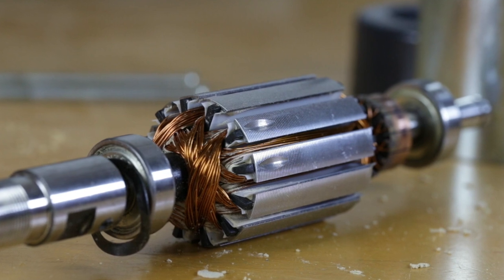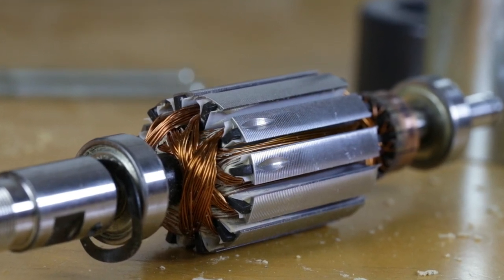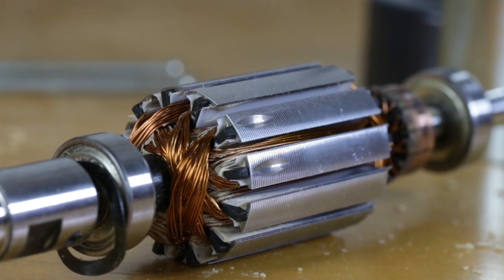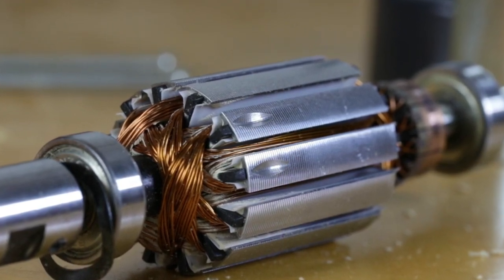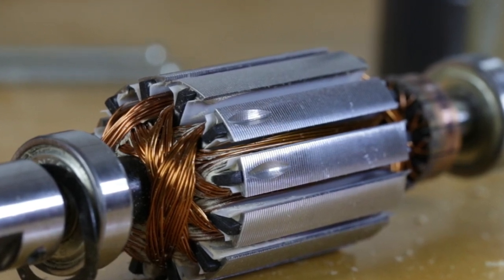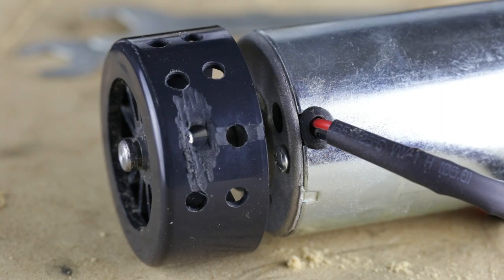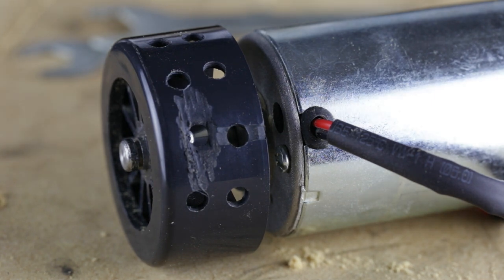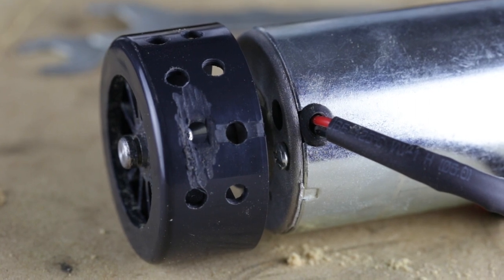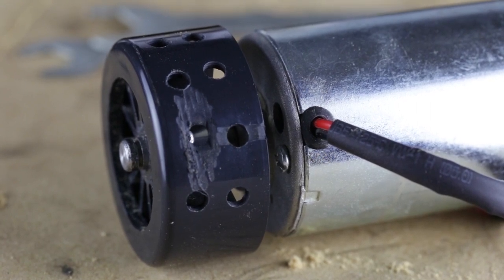In the lamstacks themselves you can see that it's been balanced fairly cleanly, which is nice. The spindle itself doesn't produce much vibration. The majority of the vibration actually comes from the fan, which was, when I got it, slip fit onto the shaft and held in place by a loose retaining ring. The first mod I actually did for this spindle was to remove those retaining rings, drive a set screw in from the side, and then rebalance the fan, which is why you see all those holes. That's going to mess with the efficiency of the fan, but I don't think that's what happened here.